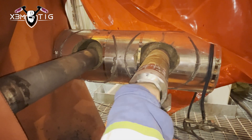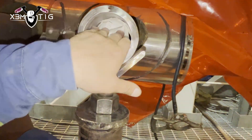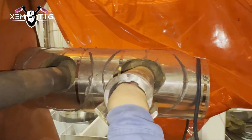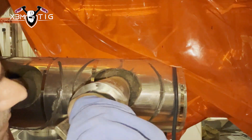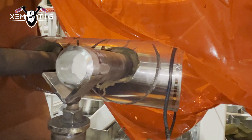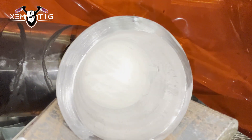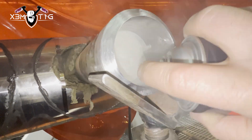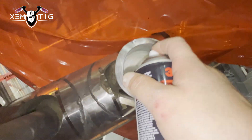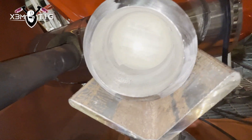The tape has to hold especially with the heat involved - tiger torch and welding heat. You don't want to break your dam, so make sure it's on a clean area. It at least has to hold for the root pass and hot pass - that's the most important thing. After the hot pass it doesn't really matter. Go all the way around, make sure there are no holes, everything is sealed and fits perfectly. Give it a little tap through the fingers to check it's holding. Then spray Super 77 all the way around the dam for an extra layer of protection - let it soak and once it's dry it'll be even stronger.